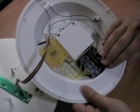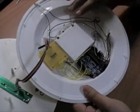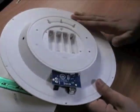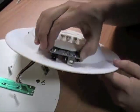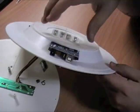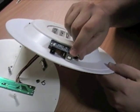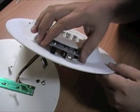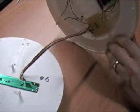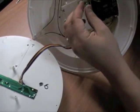I have instructions on my website on how to try this yourself along with source code examples. The only physical modification I made to the clock was to cut out a hole big enough for the Arduino. They do make Arduino small enough that you wouldn't need to cut this hole, but I really like the idea of having the USB port on the bottom for doing updates over the PC. I also wrote a little C# application that can push the date to this clock in the event that it should ever lose its time.